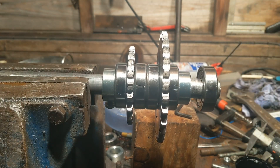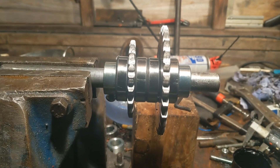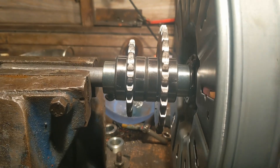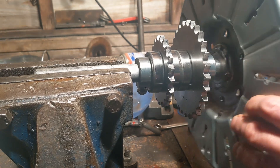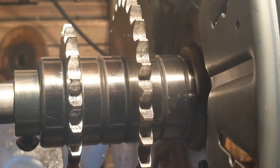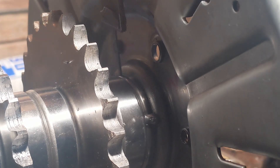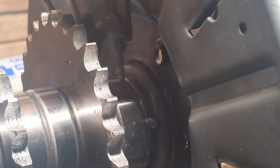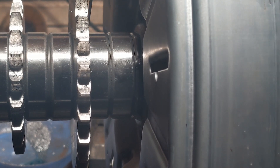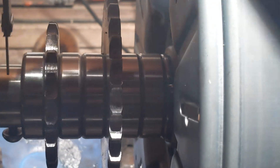That is kind of what it's going to look like when it's done in the middle. It will have the stator welded on and there will be another bearing. The reason I have to use two bearings here is to get enough room to get in and weld - from the first bearing to the bearing in the rotor, and then it's got to be welded all the way around here, and here, with another bearing on. And then it's quite symmetrical.